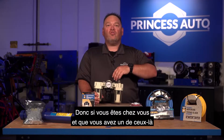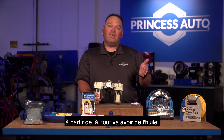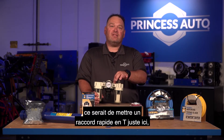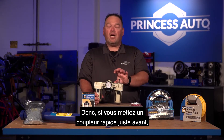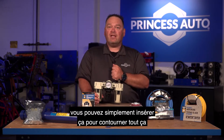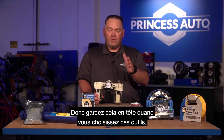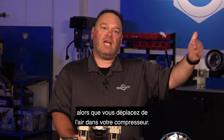If you're at home and have a lubricator running and decide you want to get into painting, everything from there on has oil in it. You'd have to disconnect everything, add new line, and start again. Alternatively, if the components are individual, you could put a quick coupler T between your regulator and lubricator to create what's called a dry line. If you put a quick coupler in before the lubricator, you could just click into that bypass and have a dedicated dry line for painting or abrasive blasting — a great way to avoid replacing all your line. Keep in mind: less is more. Don't add more than you need, because components do drop pressure throughout as air moves away from your compressor.